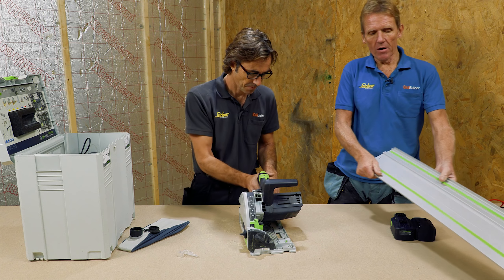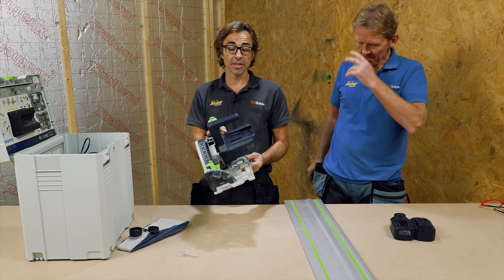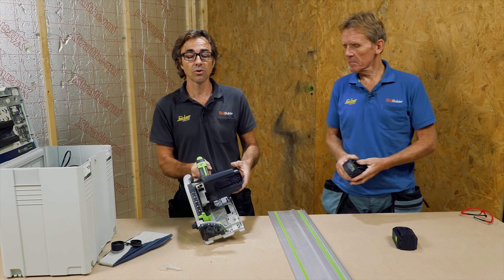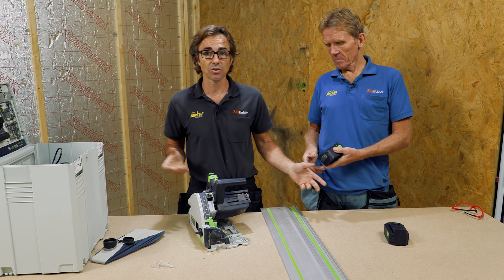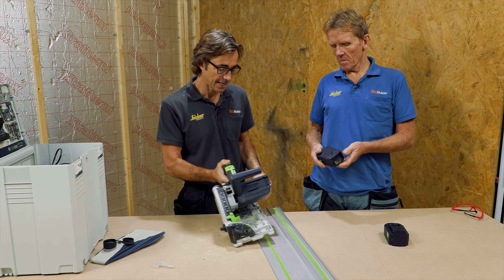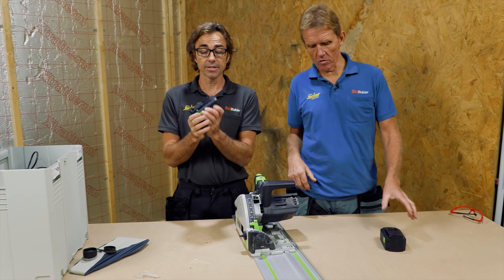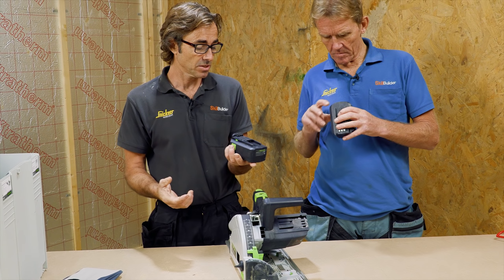Two things: one, you can scribe - a two or three mil cut. There is a scribe action on this - you can lock it off. So it's got a scribe action, but the other thing is if you're really worried, slide that splinter guard down into position to protect it as you go through. But obviously that's on the rail, because we've got the rail giving us that extra hold-down. So, what's the benefit of having this over a corded one? Brilliant if you're on site and you're doing soffit boards, running around scaffolding and ripping ply down - it's great because you haven't got the lead trailing. It's safe, it's really handy.